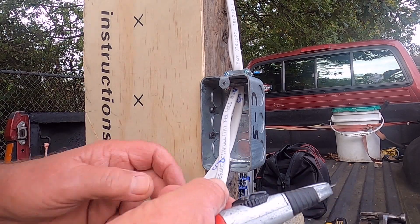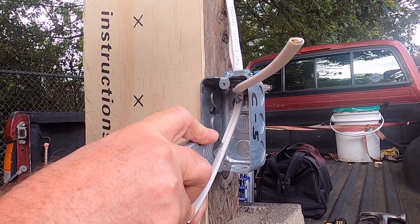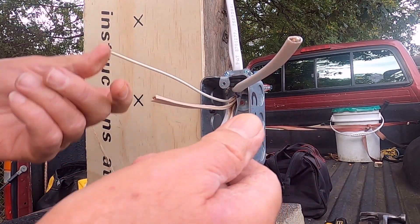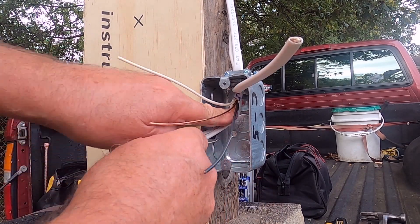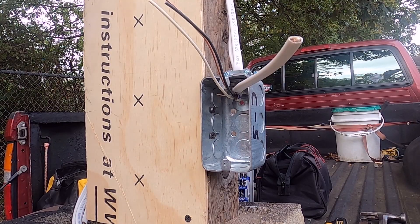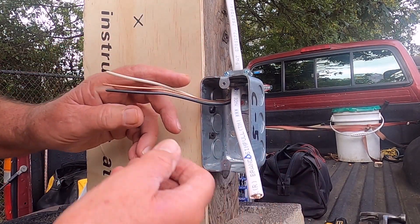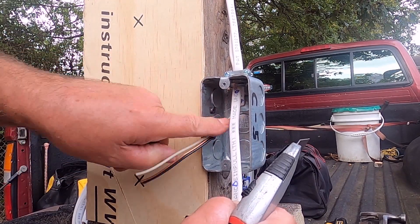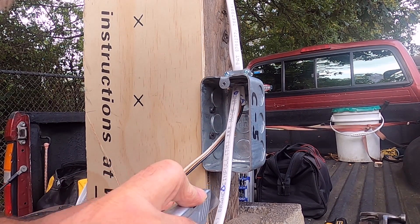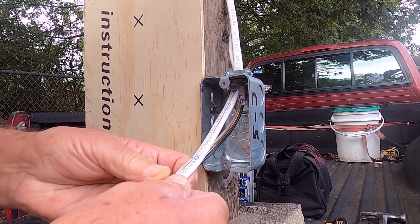What we want to do first is come in here and remove all of our insulation. Try to stay in the middle of your wire and not cut your insulation on your hot and your neutral. What we're using here is number 14, 14-2 — that's pretty much your standard light switch size wire. They make a 20 amp, which would be number 12-2, and it's more or less for outlets and higher amperages. The voltage is the same, just got more amps.